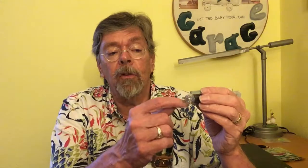These little wire feet should go into a socket, but I'm going to cheat a little and squeeze them into a 3/8 inch hole. With a little bit of super glue around the edge it holds very securely. The other nice thing about these smaller ones is they're glass throughout. The bigger ones have a black plastic base — you cannot shine light up into them. The best part is to get that light going up into the vacuum tube to show what's going on inside, though the plates running across them do block some of the light from getting all the way to the top.